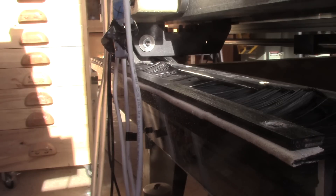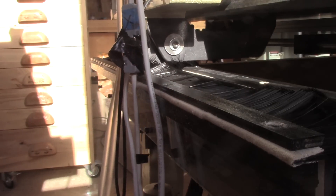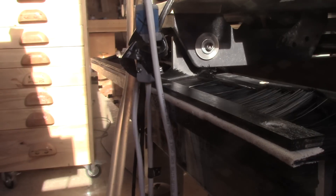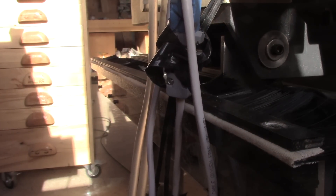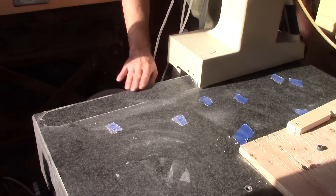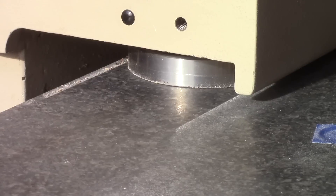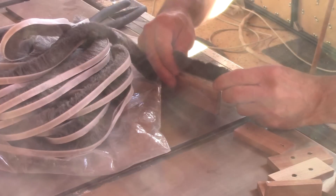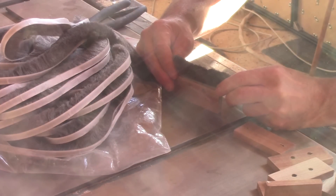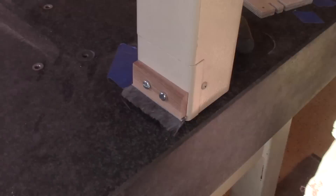I also need to cover the Y screw. Like the other two, it has two brooms. There's a bit of dust on the table — it's normal, it's a CNC. I want to push away most of the dust before it can hit the air bearings. So I stick some window seals on pieces of wood. I made six of them that I screw on the cast iron of the CNC.